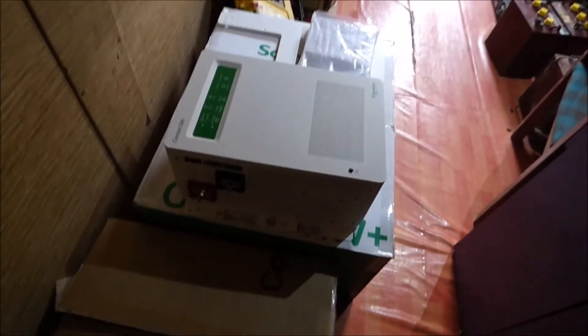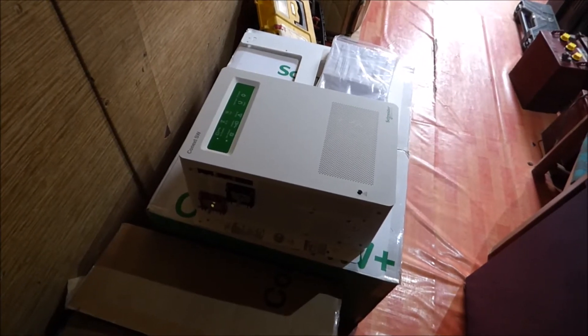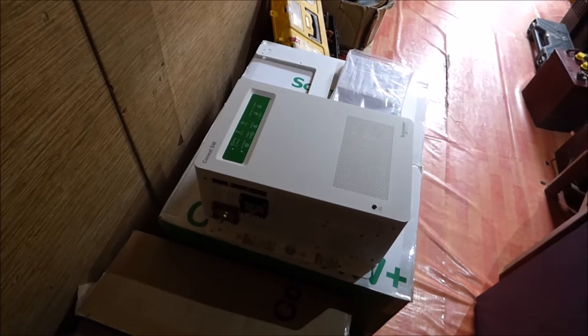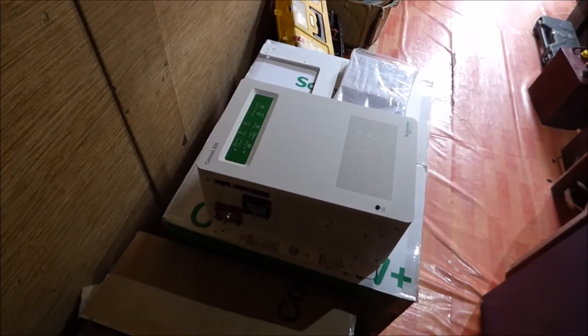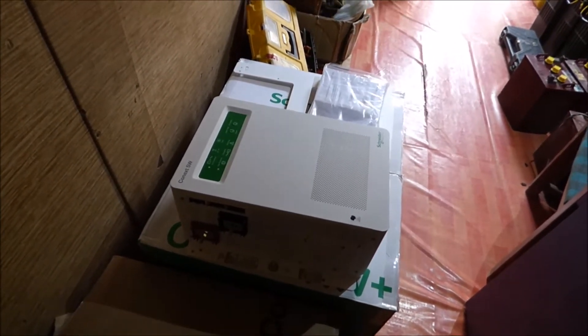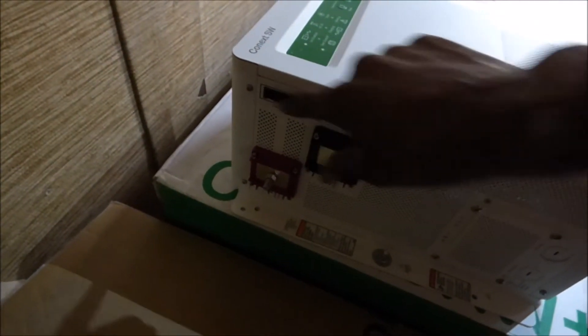As you can see, it's a very beautiful looking inverter. What I like is the fact that it comes with battery temperature sensors, and it also comes with the ability to communicate with them either using an SCP or a combox. We can talk to them remotely using our handheld devices, just like we can on the big brother, the XW Plus. Here are the battery terminals, here is your grounding lug, and these are your communication ports.